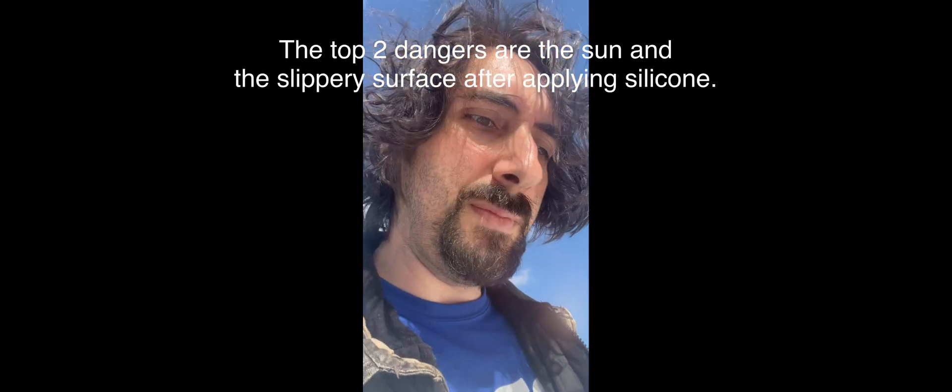The third step is to apply wet patch along all of the cracks to seal them. I'm showing what we're doing up here — applying a silicone overlay. There are some black spots, so I'm going to put wet patch along those cracks and in areas that could leak later, like near the vents and the swamp cooler. Once it's applied and dried, we can begin with the silicone. To use wet patch correctly, you apply a coat first, put the fabric tape down, then apply another coat as instructed.